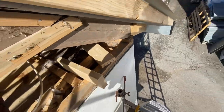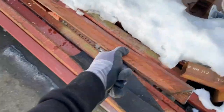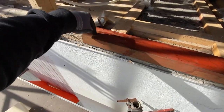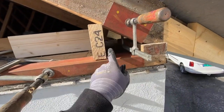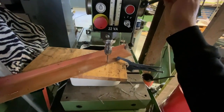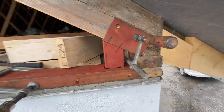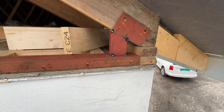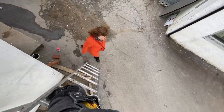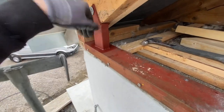I'm going to need some steel. This one in the bottom will for sure be a really good support down there. We make holes here and we're going to have one bolt down to the concrete. The top bracket is also sorted. I'm making a solid piece between here. I welded this together, put a few tack points to keep it in place, tested it — fitting good. Now I'm welding it totally. Both supporters are now in place and looking good.